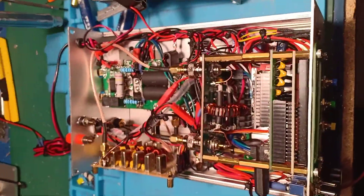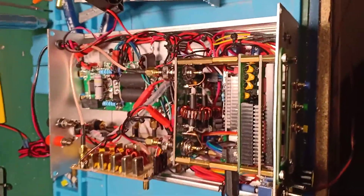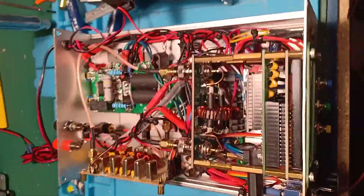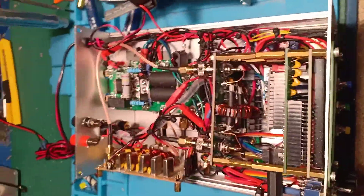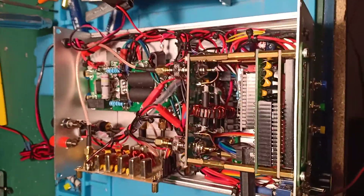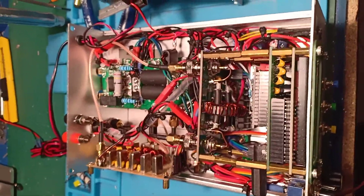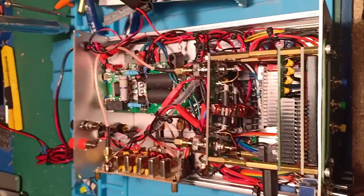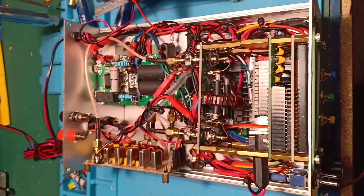The main issue with this kind of MOSFET amplifier is thermal runaway. The problem is that as the MOSFET gets hotter, the internal resistance changes — there is a kind of domino effect. As it gets hotter and hotter, you get more and more current to the drain, affecting the biasing.